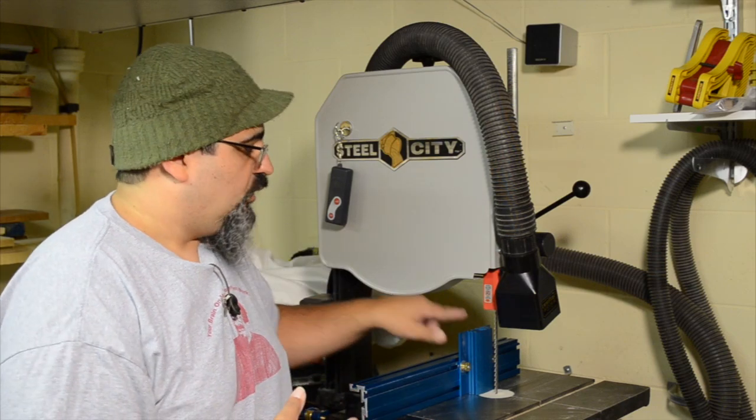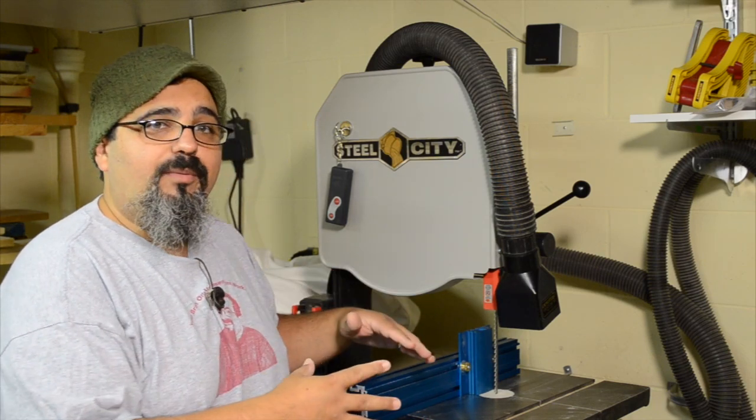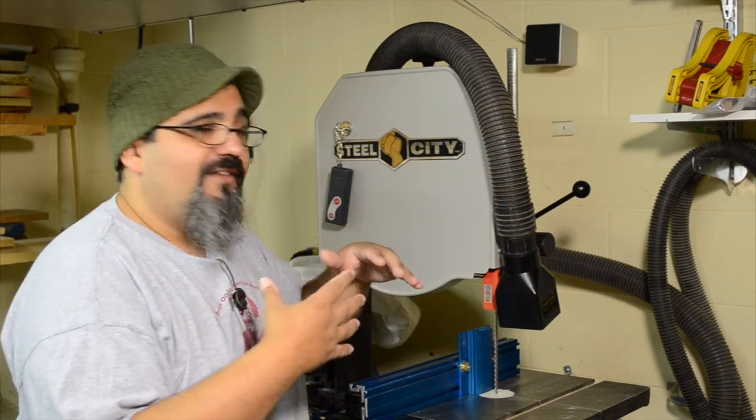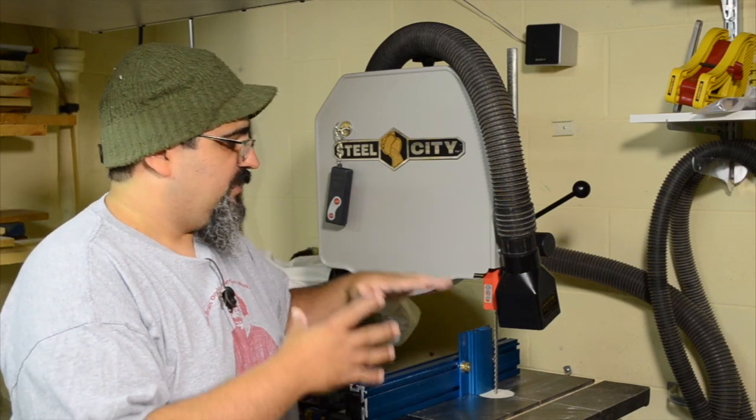Maybe making your own veneer is exactly what you prefer to do. You'll get more veneer off a bandsaw than a table saw because of the thinness of the blade. But equally importantly — actually more importantly — are the safety features. With a bandsaw, you're not worried about kickback. You have way more control as you're cutting into the material. It really is the better tool when it comes to re-sawing.